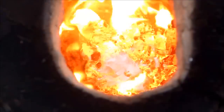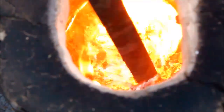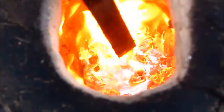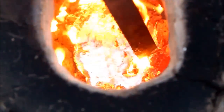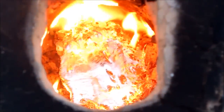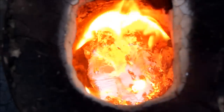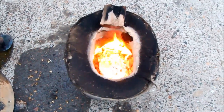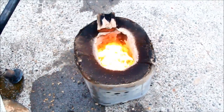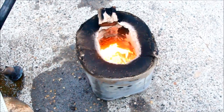After the alley had been in there a good 10 minutes I shut the thing down, pulled the vaporiser tube out and that's what I had — well and truly liquid aluminium. I'm just scraping the bit of slag off the top. You could easily put a tap on this and just drain the molten alley out into a container if you were doing it for scrapping or trying to separate it from steel or other metals.